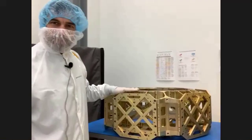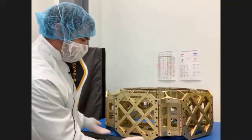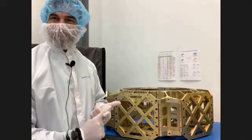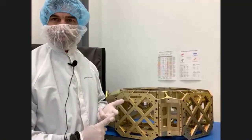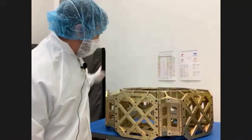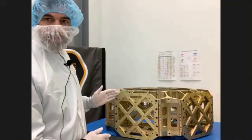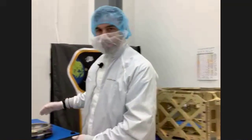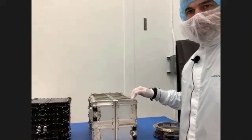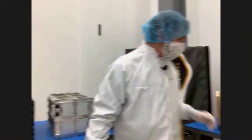This is the basic chassis of all the Sherpa variants. It's an aluminum hexagonal shape. On the base, we have a 24-inch interface, which makes it compatible with the SpaceX rideshare port, the SpaceX Starlink rideshare port, and compatible on U.S. government missions that fly at ESPA Grande. On the outside, we have six radial ports on hexagonal faces, and this can accommodate a variety of separation systems — the 8-inch motorized light band, the PSLP CubeSat deployer, and the QuadPak CubeSat deployer. All three of these are compatible with these plates.